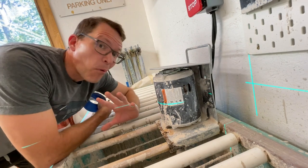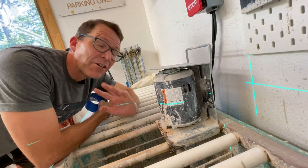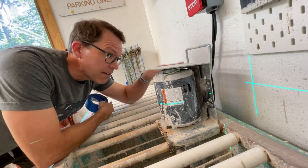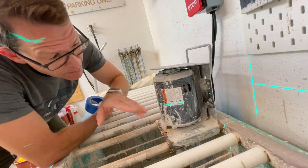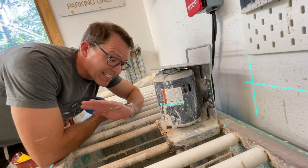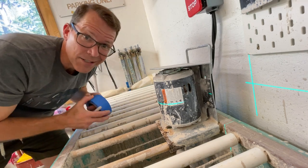The final big technical important fit is: will the motor actually fit onto the new mount? To find that out, we'll have to take the motor off of the old mount. Before I do that, I want to carefully mark on the wall where the center line is — I want to make sure that this motor gets mounted at the exact same height from the bottom of the slip tank as it is currently sitting. Thank God for lasers.